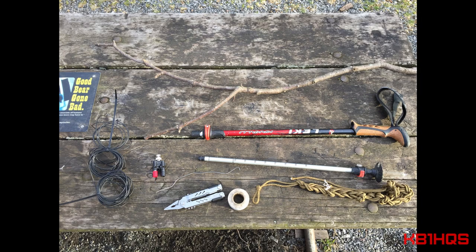During this particular hike, I decided to get a little creative and see if I could make an antenna out of them. With the formula for a dipole antenna for two meters, 19 inches was probably just about right. Unfortunately, I did not have a tape measure with me. I did have paracord, some electrical tape, a BNC-to-banana-plug adapter, a multi-tool, and some miscellaneous wire. So I was like, how is this going to work? I still didn't know the ultimate dimensions I needed for the antenna.